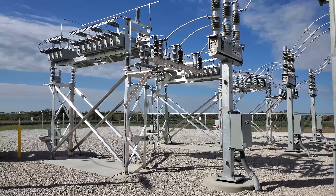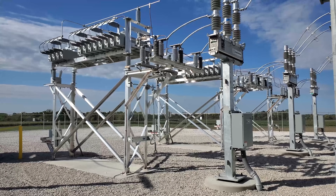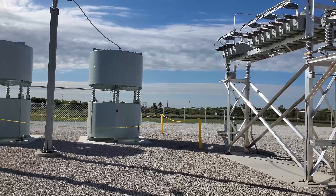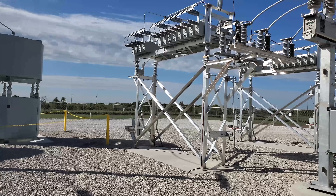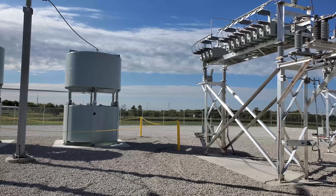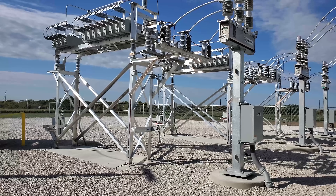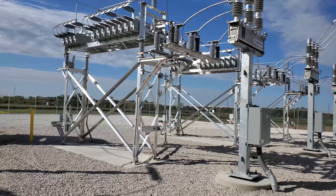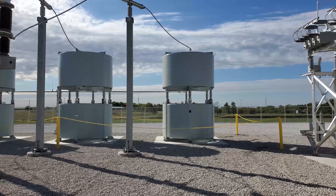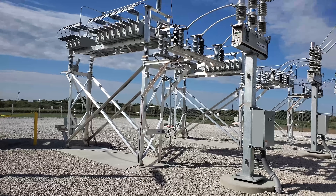There are certain cases where you can purchase a power factor correction system from the turbine manufacturers. It's a pretty expensive system — I think it doesn't pan out money-wise — but it eliminates the need for capacitor banks here at the substation because they have them built into the turbines themselves. So at some wind farm substations you'll see capacitor banks and reactor banks; at others you won't. Some substations have just capacitor banks or just reactor banks. There are a lot of variables that go into figuring out exactly what each substation needs.